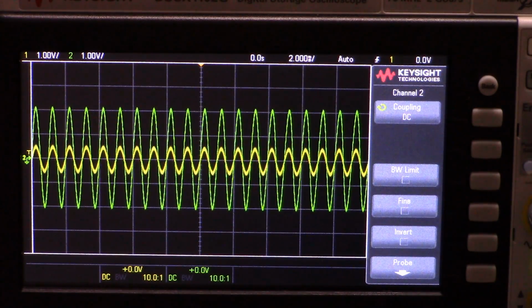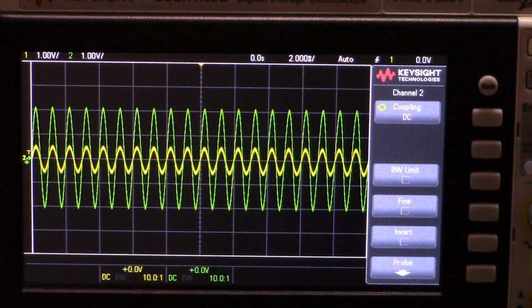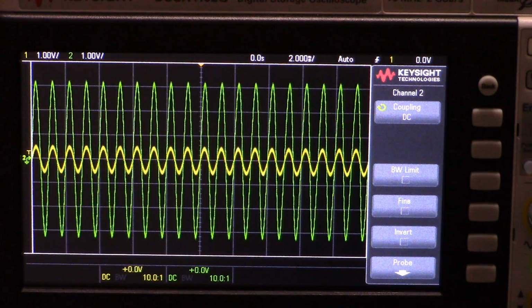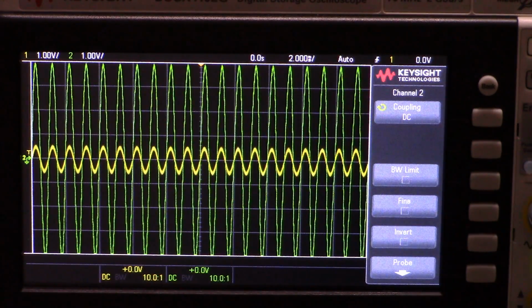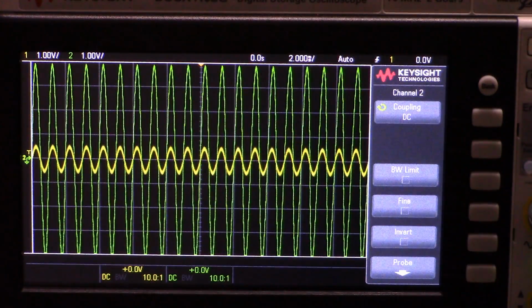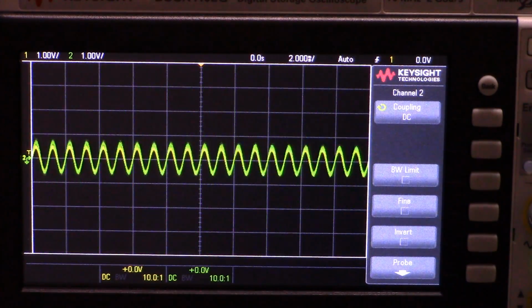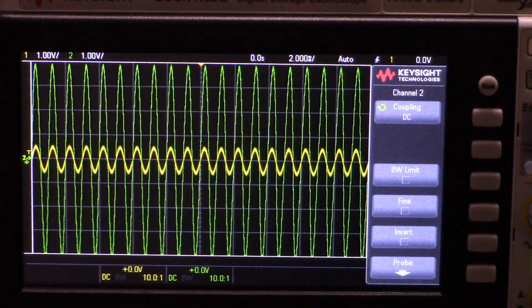And then I do my volume all the way up and down, and we go from 0 to 4 to 0 to 4. And then if I go down to this resistor and turn it up instead, I can get all the way up there, and of course I can start to clip, but I have 14 volts on my supply, so 8 volts peak to peak is not going to be a problem. So now we're at 8 volts peak to peak, and I turn my volume knob. I haven't done anything else to the circuit. Turn my volume knob up and down, and now we have an 8 volts peak to peak output swing.